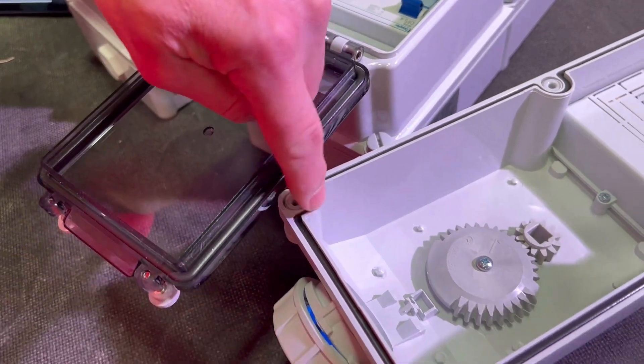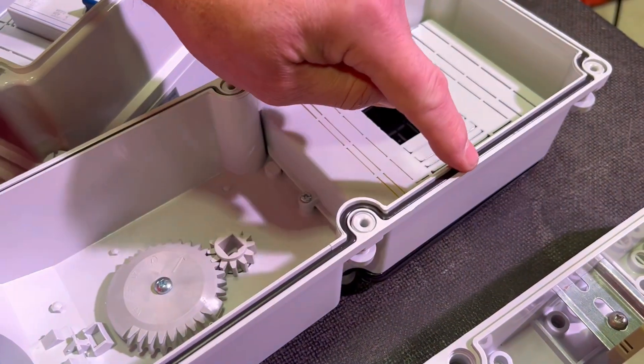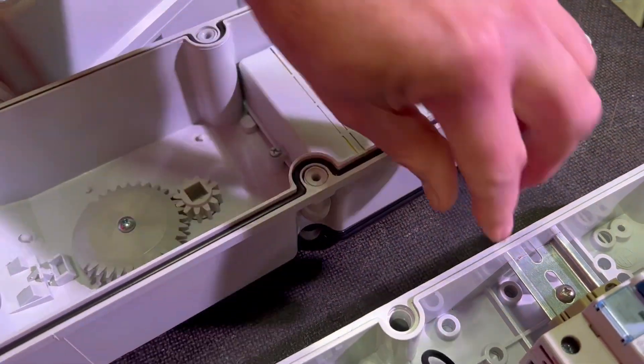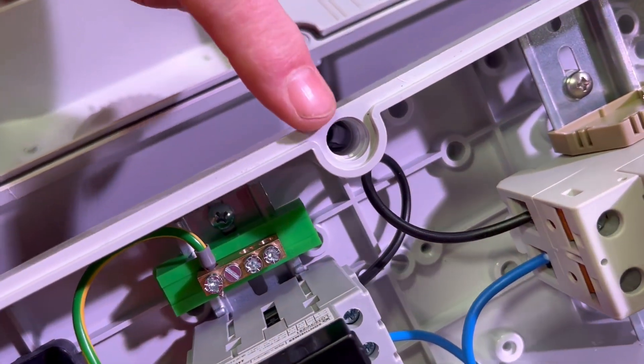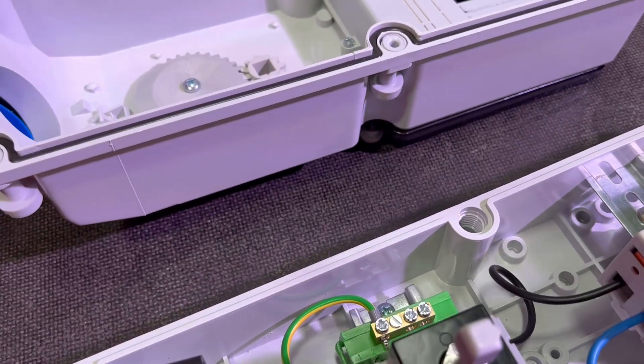Under the cover of the socket front and the switchgear cover itself, you'll see this gasket which is moulded in place, so there are no joins or gaps for water to sneak through. The wall mounting screw positions sit outside of the gasket and sit under the cover fixing screw, so no water is coming through here either.